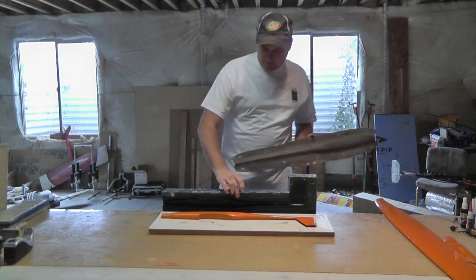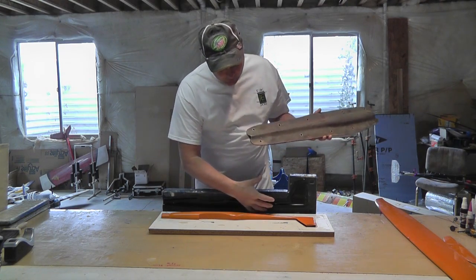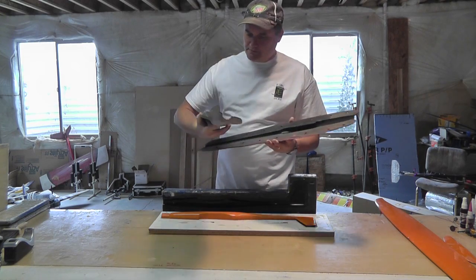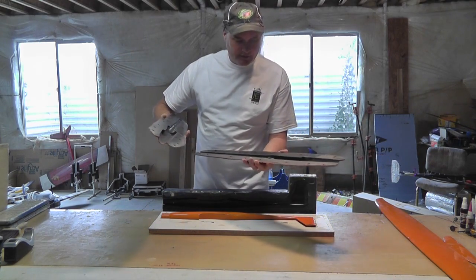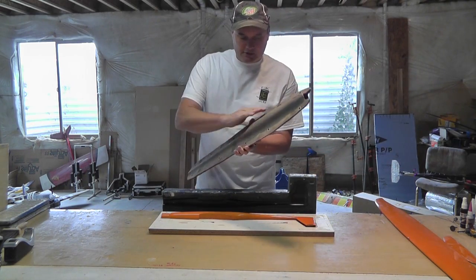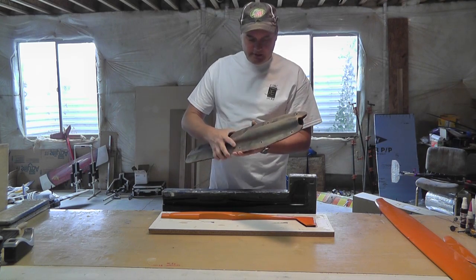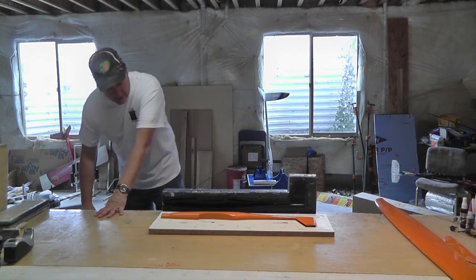You can also make molds like this that are just fiberglass and epoxy - the mold itself. It's a little dusty and needs to be cleaned up to be used, but they're built essentially the same way - just not as thick and they won't hold pressure. I've tried to use a bladder on this one and it separates at the seam line. But that's another way to make a mold if you don't need to use air pressure.